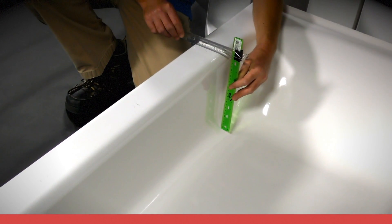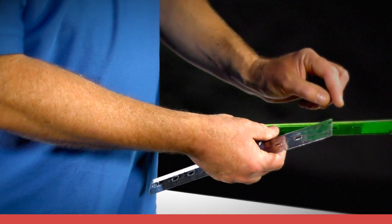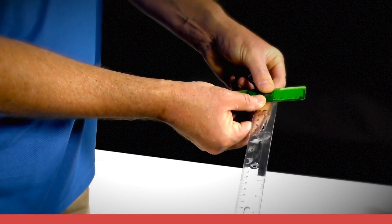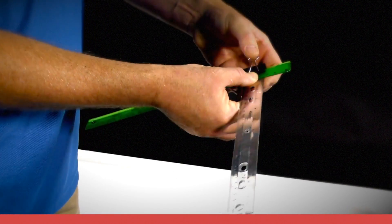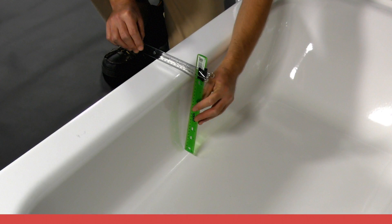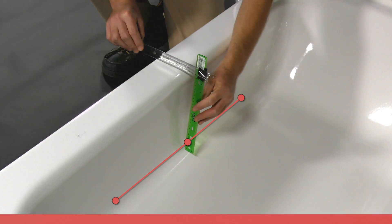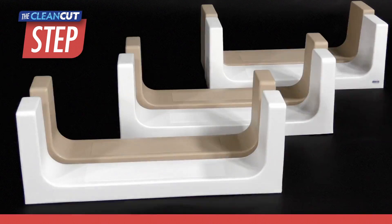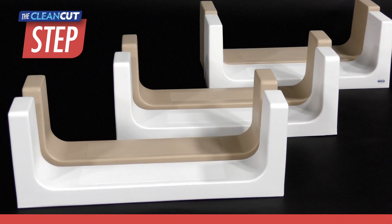Measure approximately 9.75 inches down from each of the three points on the top rail and measure in the width. To take this measurement, it is helpful to assemble a simple measurement device: take two rulers and connect at 9.75 inches, as shown on one of the rulers, and connect using a binder clip or other type of fastener. Use the measurement tool and note the three bottom measurement points — these are your bottom rail measurements. This chart represents the maximum top and bottom rail measurements for each of the three sizes of CleanCut Step, and your measurements cannot exceed the values shown. As a reminder, the product is available in both white and beige.